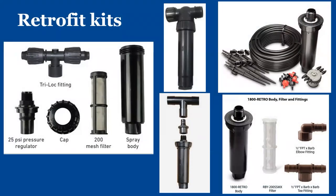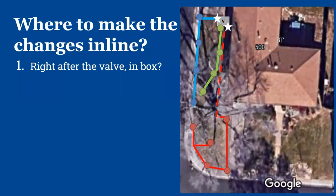Here are a couple of varieties of retrofit fit kits you might see. They'll come with different bits and bobs. The upper right is actually the one I have here. Personally, I don't really care for ones that come with a whole lot of extras, because inevitably you'll have not enough emitters and too much other plastic I don't need. I'd say just keep it simple with the filter, the pressure reducer, and the additional little attachments.